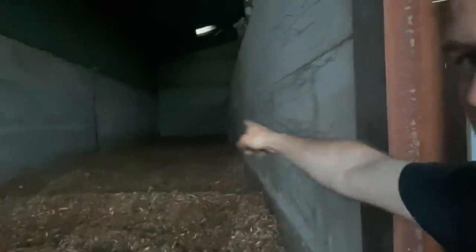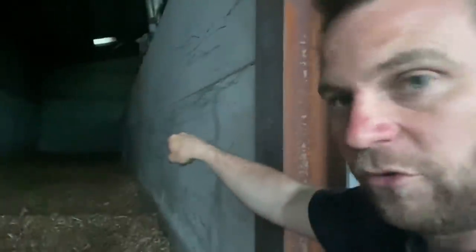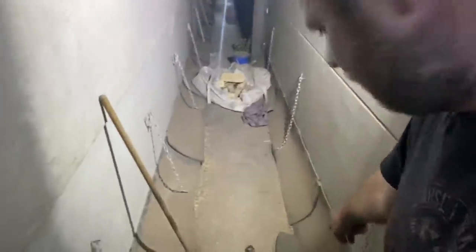So the back wall of this shed is the air tunnel for the first floor that we just looked at, and then it can do a right and come down here. So at the far end of this tunnel, right down there where that light is, is the sliding door that we can open and close. When the door's closed, the air just goes straight and goes out through one floor, which is the one right by the boiler. When we open the door, air then comes down this way, and we can put it underneath that floor there, or underneath that floor, and then rubber flaps on chains there. We lift them up and down and we hook the chains on these spikes. And then that opens it, and the air can escape through whatever product we put on the floor.